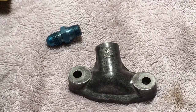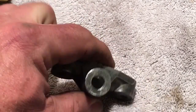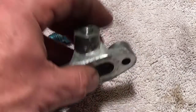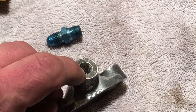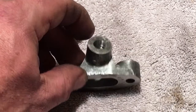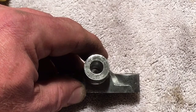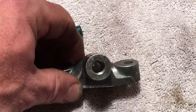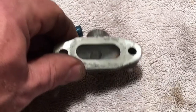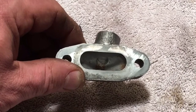You're also going to need a 21/64th drill bit. Here's the weird part — when you go to open this up, you're going to open that hole from the stem into the oil feed portion. The top of this is already bigger than 21/64th, so you'll literally stick your drill bit in there and it won't touch the sides. You'll clean out dirt and then start hitting aluminum. Just hold it as straight as you can and keep drilling until you poke through into the cavity. That's a 21/64th hole into the oil cavity, which will be the supply.